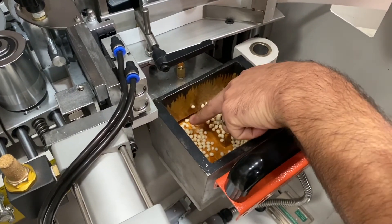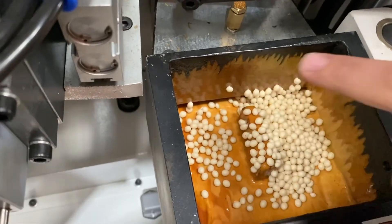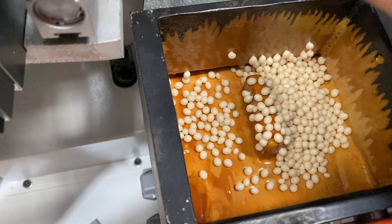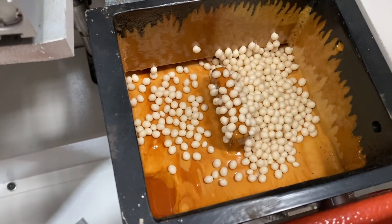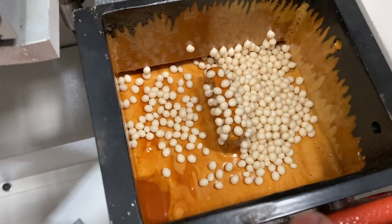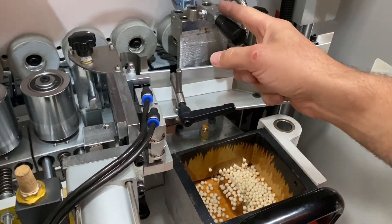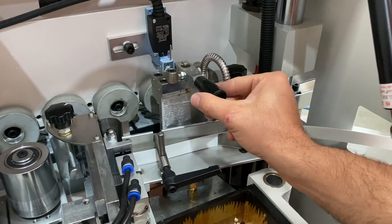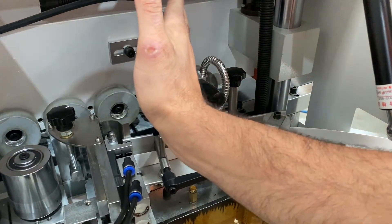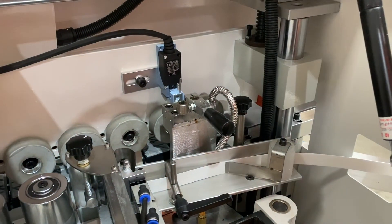You don't want to fill it up more than this gap down here — you need that little gap at the bottom. That will allow the glue pot to breathe. There are two chambers, one here and one there, to allow the glue to breathe, prevent it from burning, and stay a lot cleaner. To adjust how much glue flow the machine applies, loosen off this nut, adjust the bolt, and that will turn the lever left or right — one way puts on more glue, the other way less glue.